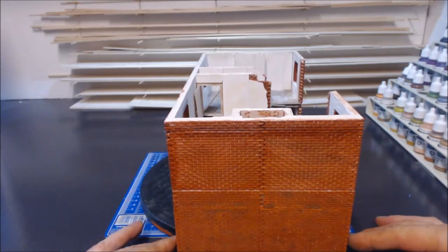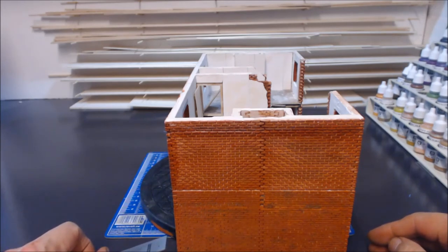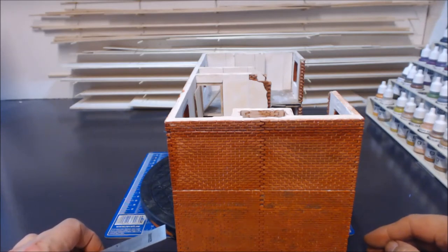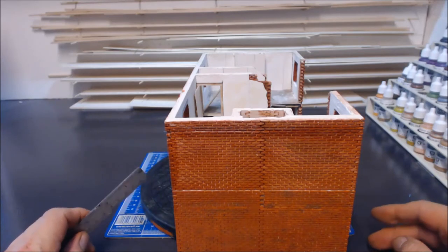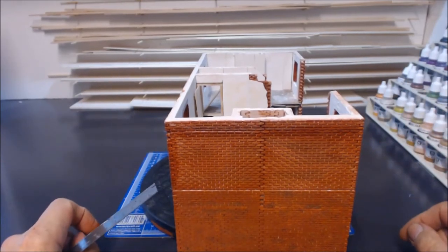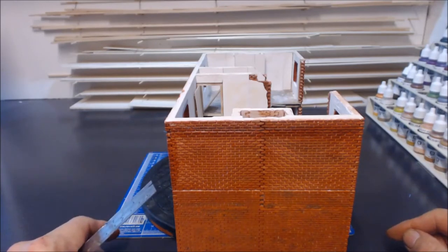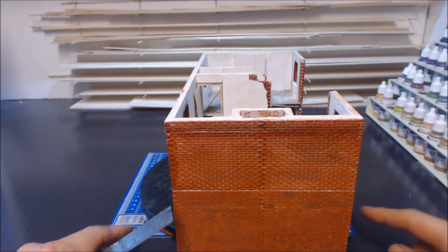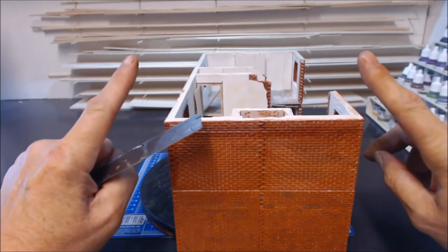There are no real set rules for the pitch of a roof — if you look around you'll see all different pitches. But going back to the 1930s, the pitch was quite steep, roughly about 50 degrees. The simple reason was they did it steep so they could get extra room in the attics and put dormers in without adding much to the cost. That's what I'm going to stick to — roughly a 50-degree angle.